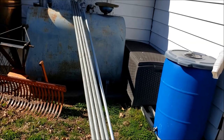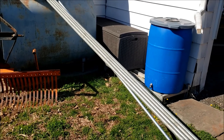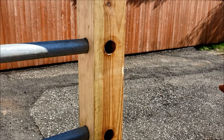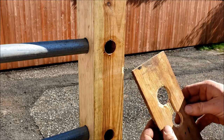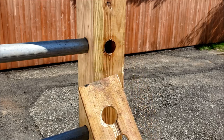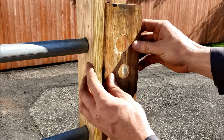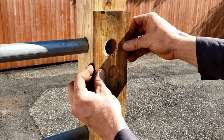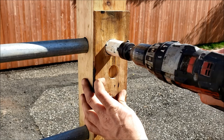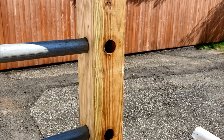Quick tip: since I already had my holes drilled for the one and three sixteenths, I had to enlarge them to one and three eighths. You can take a piece of wood with your hole saw, drill a pilot hole, clamp it exactly where you want it on the post, and then run the hole saw through. That way the bit isn't jumping all over the place and scoring up your four by four.